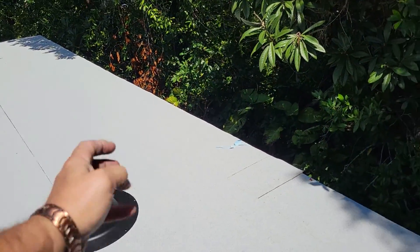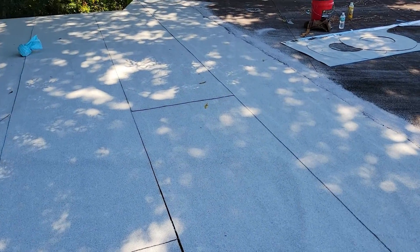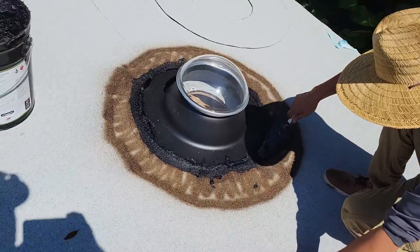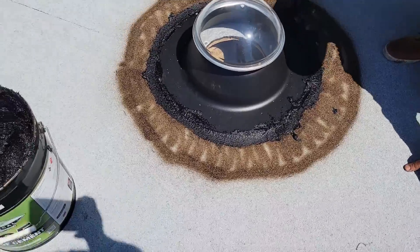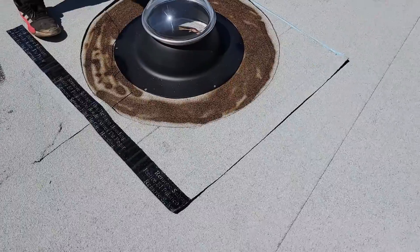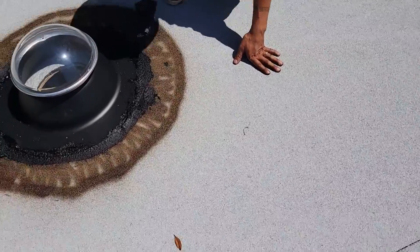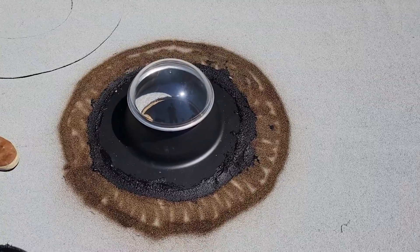Whatever you cut off of that end, you take back at the other end to start with, and they'll just keep stepping up. Then what we're doing is modified roofing cement where the flange touches the metal — it's primed all the way around inside of the circle. We'll put our targets on, and then we'll butter the seam, it's called, on the high side of the lap.